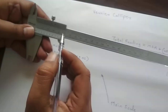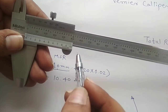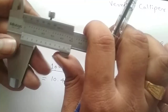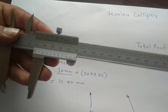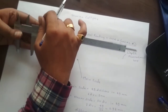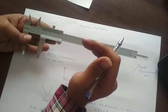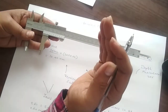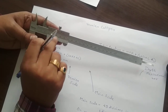In the next video we will see how to measure inside dimensions. We have seen the concept for millimeters, and the upper scale gives readings in inches but the concept remains the same. Using this instrument you can measure outside features, internal features, and depth. A regular scale can only measure down to one millimeter, but if you want to measure less than one millimeter you need the Vernier instrument, which utilizes the principle of two scales. Thank you.